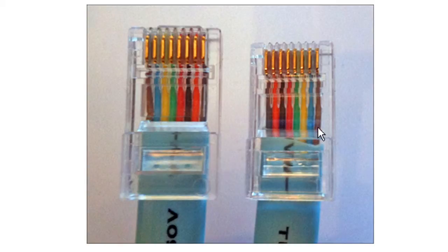You can see here that we have brown on pin 1, brown on pin 8, blue on pin 2, and blue on pin 7. One downside is that cutting the blue flat cabling is a little tough because it's pretty thin and you're right on top of the wiring — when I cut it I did nick the wires underneath. If that happens, just cut back a little further and try again. You might be limited in the length of cabling you can create from these blue rollover cables; they're great but you're not going to be able to make a 15-foot async cable. If you've got shorter ones, they're not going to reach too far, so keep that in mind.